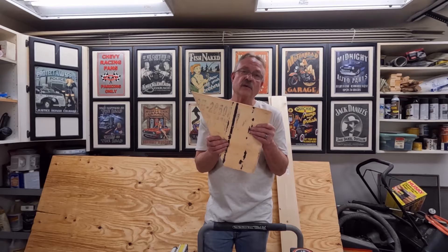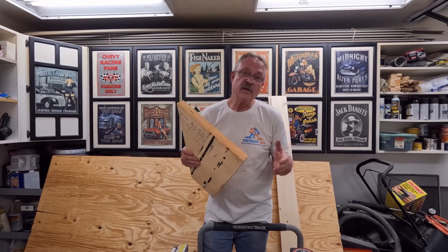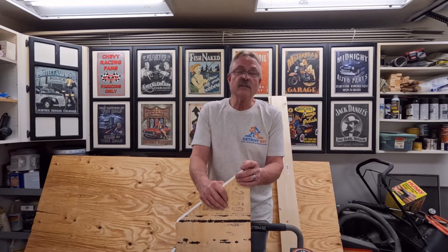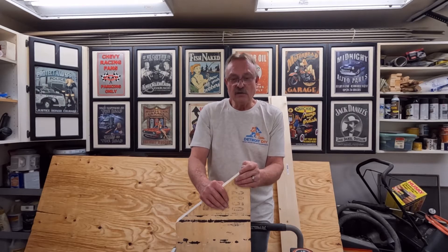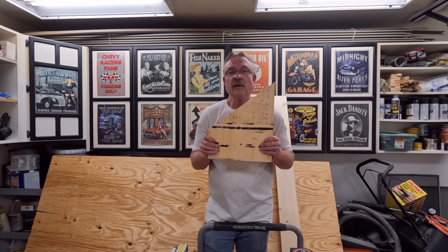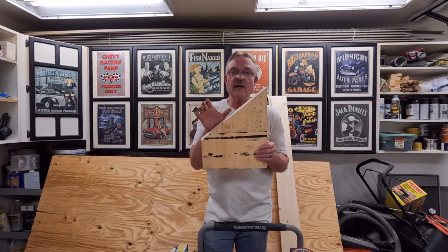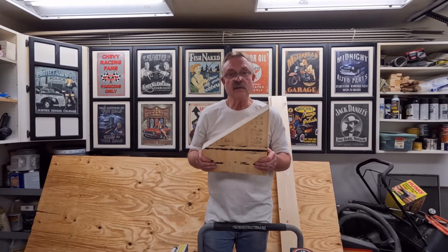In construction, you will rarely ever see a single 1 and 3⁄4 inch LVL beam anywhere in a house. The only place you may see a single LVL beam is for stair stringers. That is what I use this for — I just installed a set of stairs using 11 and 7⁄8 by 1 and 3⁄4 by 14-foot LVL beams for the stair stringers. There are three of them. It makes the stairs incredibly strong — no squeaking, no creaking, no flex. And because they're a little wider than their dimensional counterpart, where a 2×12 is 11 and 1⁄4 inches, these are a true 11 and 7⁄8 inches. So there's more material left once you cut your rise and tread out of the stair stringer.